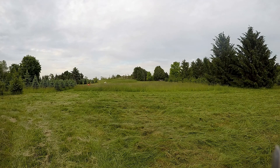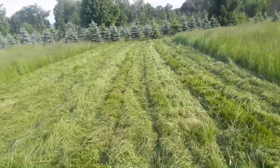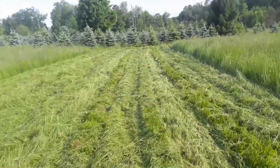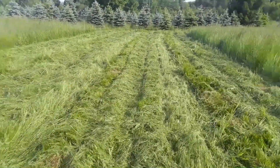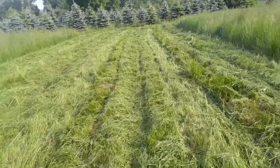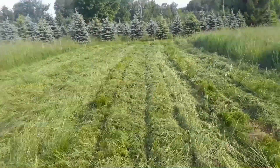With the low PTO speeds you could get a passable cut if you're going really, really slow, but then of course you're going to take forever to do your field. So the winner is test two — that one had the most consistent cut: full 540 PTO speed, tractor in low gear, about half pedal. Which is pretty much what I've been doing already.